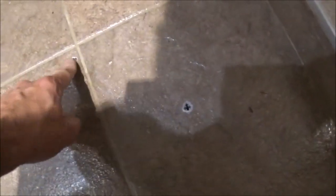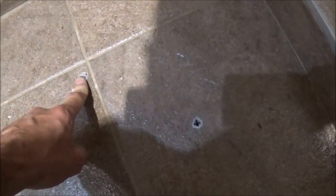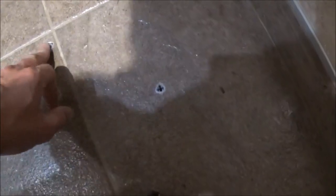We've got our plugs now flush in the ground. You need to make sure you drill a hole deep enough to get them in. Because what you'll usually find with tiles is the edge with the tile is always a bit tighter than the masonry underneath. So what I do is use a little rubber mallet so you don't damage your tiles. When they're just sticking proud and you push them in as far as you can by hand, just get your mallet, just give them a gentle tap in. You'll find this bit's nice and tight around the edge and the other bit should squeeze out when you screw the screw into the hole.